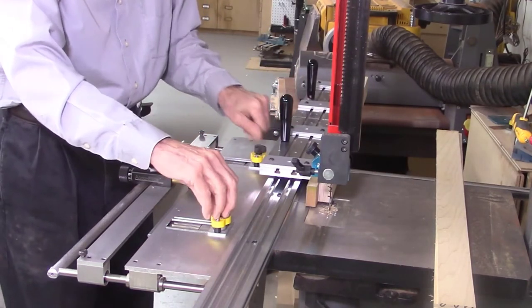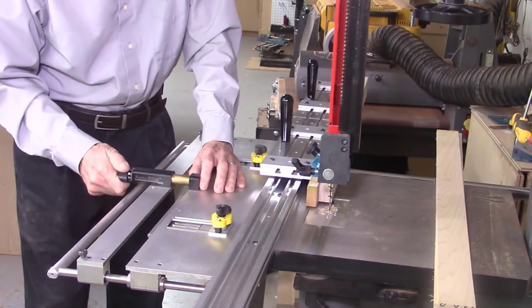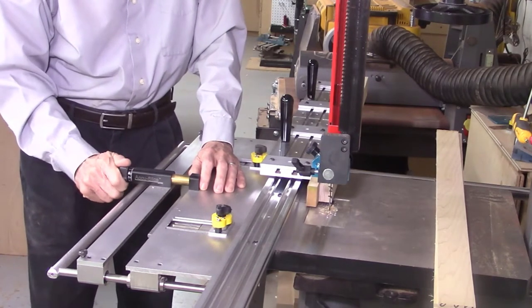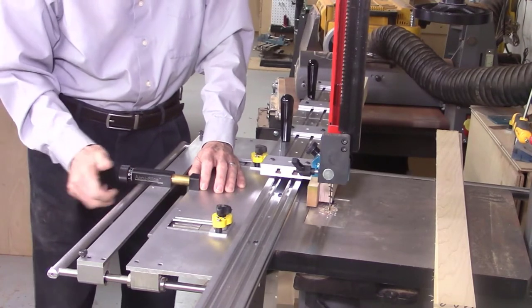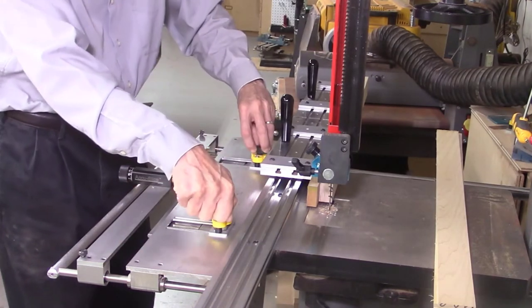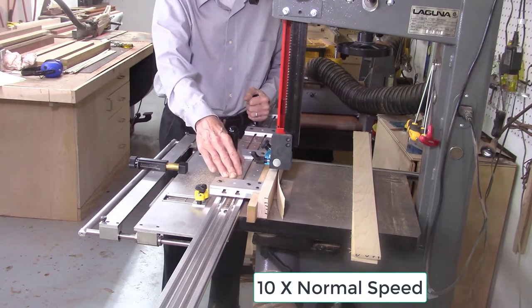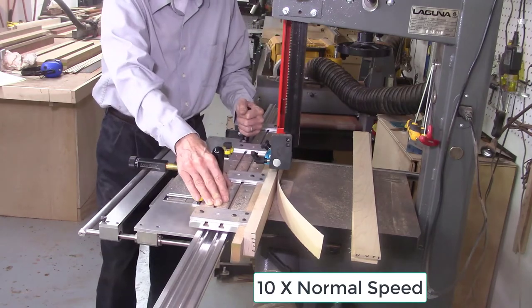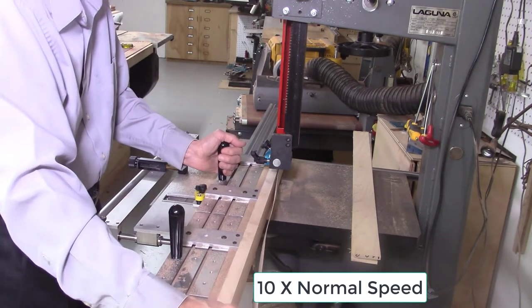So once again, I release my MagJig clamps, I do one revolution for the kerf of the blade, and then I'm cutting a board 5, 10, 15, 20 thousandths inch thick. And lock my MagJigs in place. Additional board slices, 20 thousandths inch thick, are cut in the same manner. The variation in thickness of the subsequent boards is within 1 or 2 thousandths of an inch.